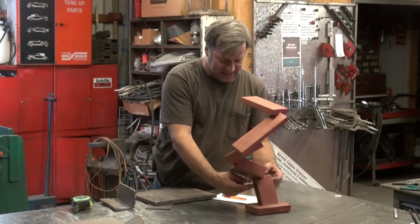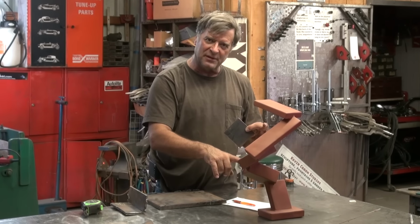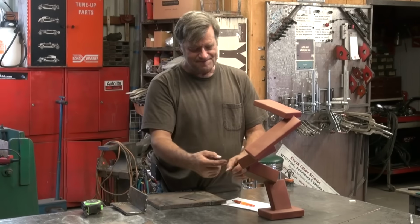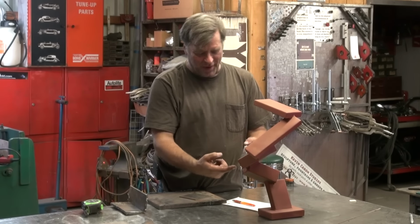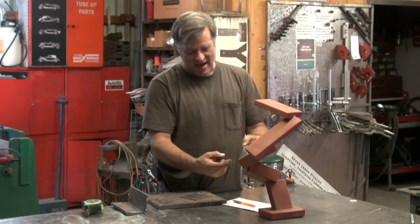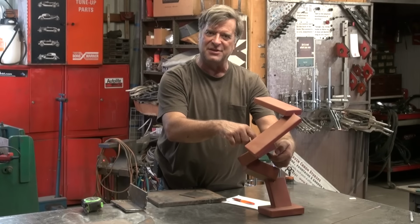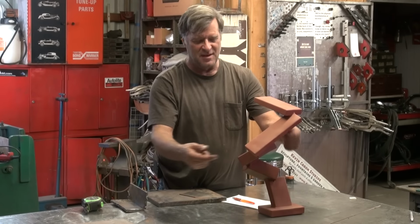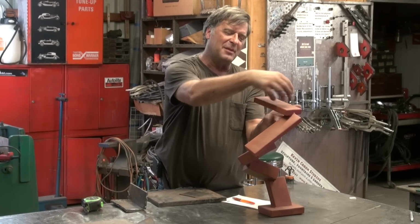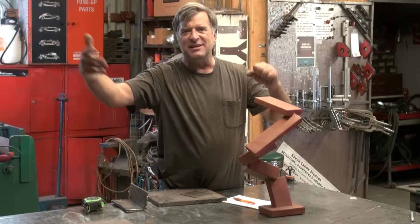And then the next piece up, I'll probably use 1/8-inch. Get those all welded together. Then I'll go to 16-gauge. Now, see, the mind's going. Where this block is going to tie into the 1/8-inch block that's underneath it, I'll use 1/8-inch at the tie-in points. The points that don't have anything tied to them, I'll use 16-gauge. And then 16-gauge at the top. This one all out of 16-gauge. And then probably the tie-ins, the base, 16-gauge, the top, probably go up to 18 or 20-gauge.